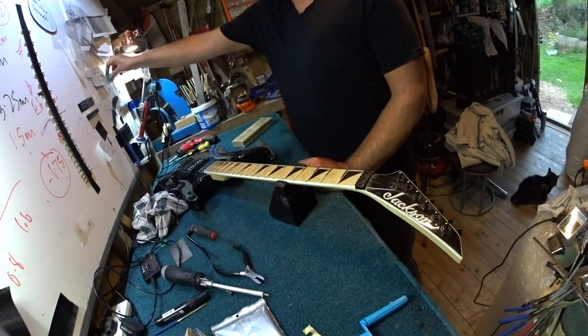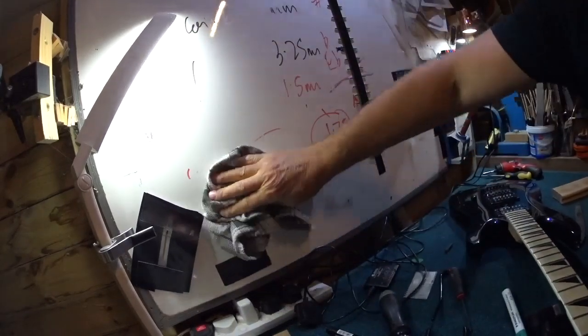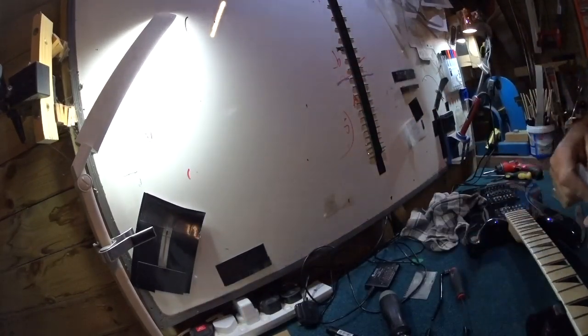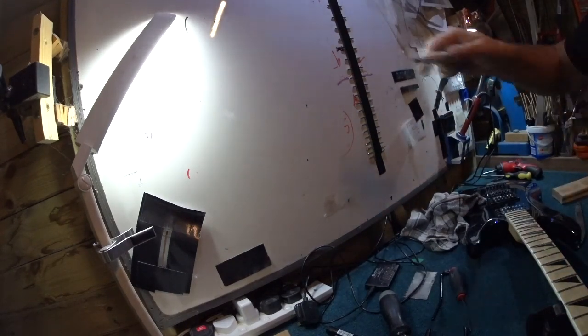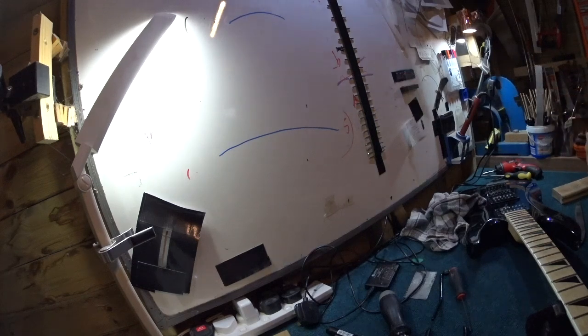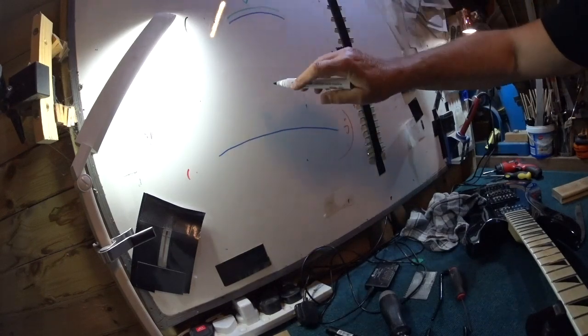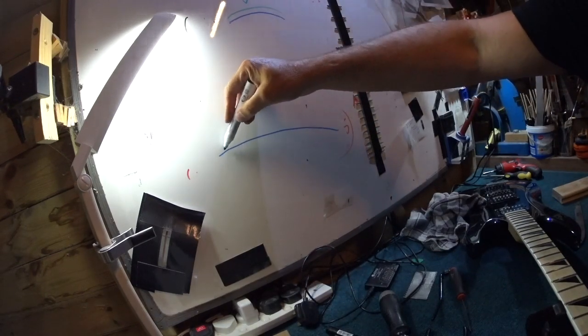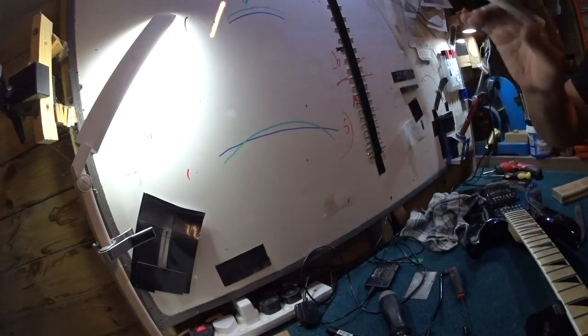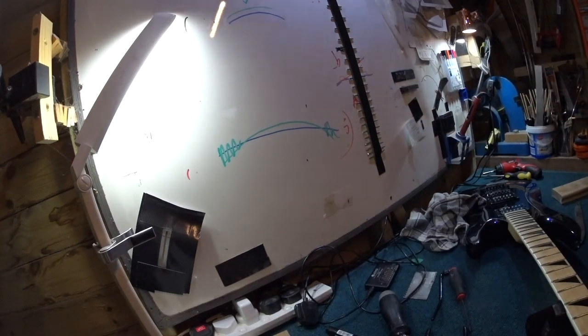And I could bore you with a drawing, but I'll show it you as simply as I can. The reason is quite simple. Let's look down the neck of the guitar. Okay, here's a 12-inch radius at the neck, and here's a 14-inch radius down at the other end, and all the radii in between. If I come down here with a 12-inch radius block to sand it, it's all very good at this end. But by the time we get down here, we will be imposing a 12-inch radius onto that 14. That's exaggerated, of course, but it will hammer off the ends before it even touches the middle. So that's why a radius block is no good.